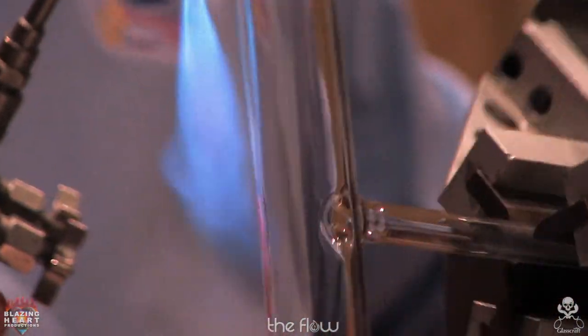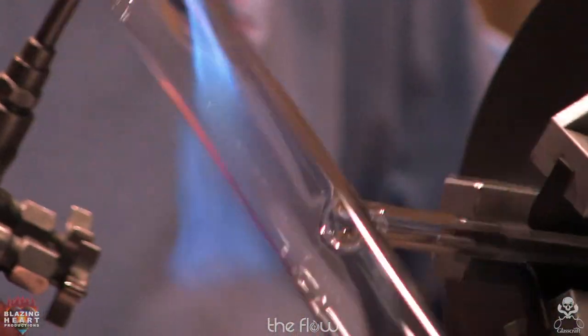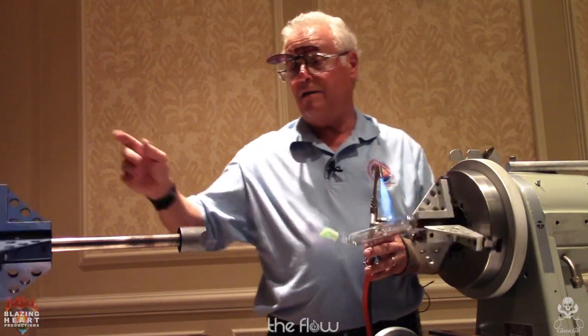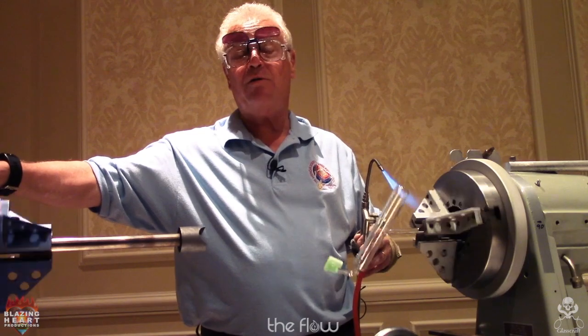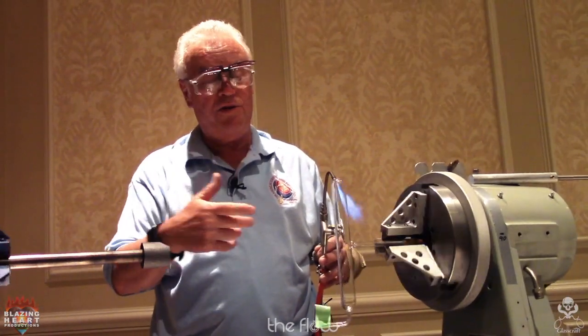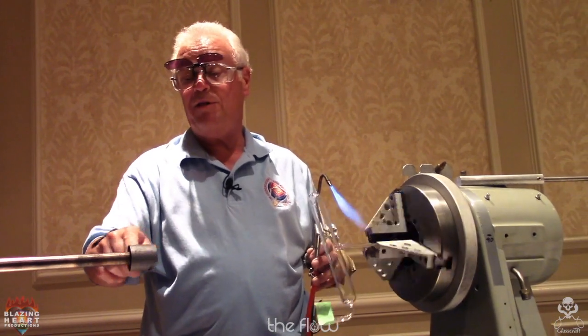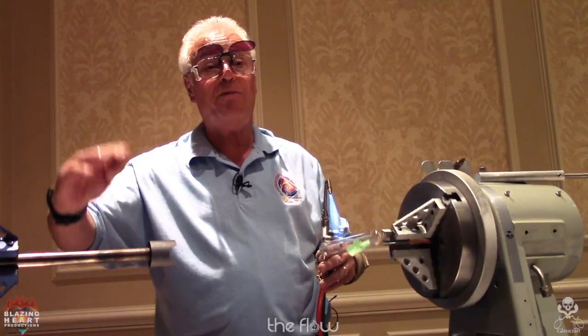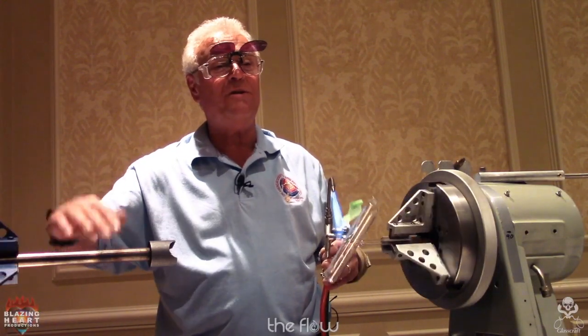They use a milling machine, actually. And the other key, or there's actually three keys here. One, the rotating vacuum swivel, so you have enough vacuum power to hold the tube on there. The graphite piece. And this stainless steel tube has to be straight. It can't be crooked. So you don't want to use a piece of plumbing pipe.